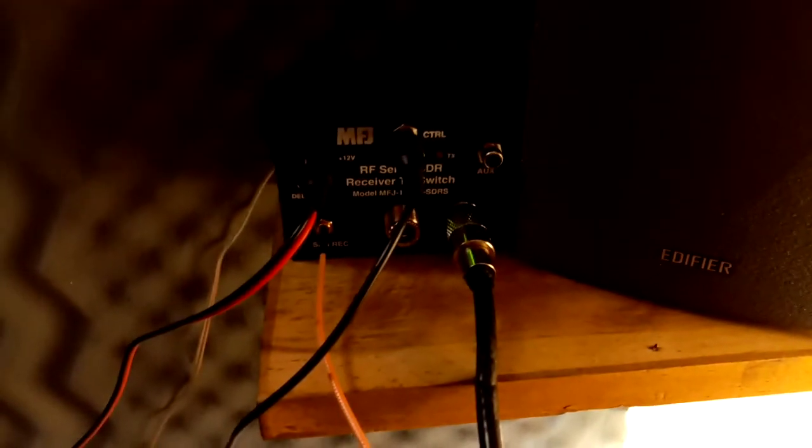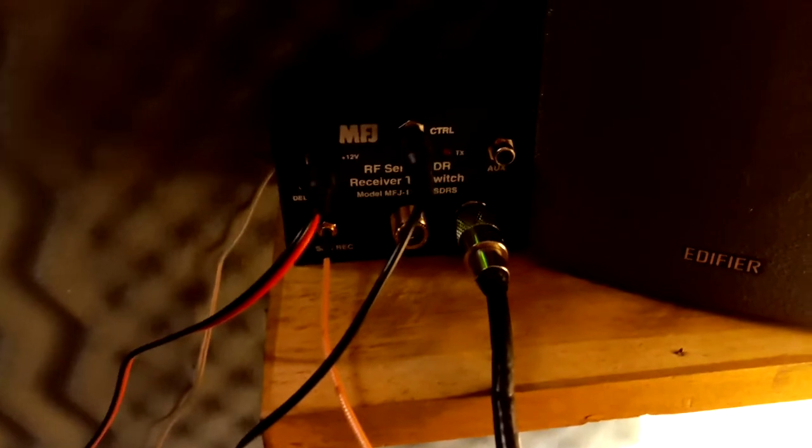Hence, the additional switch. So you bring your antenna feed. This is the antenna line, which comes in from the diversity antenna, which in my case is a vertical. It's a quarter wave. Let me pull this out so the light's a little bit better. It is a quarter wave on 75 meters, and it switches via relay into a half wave 40 and up with a 49-to-1. 49-to-1 is switched in. So on 75 meters, it functions as a vertical quarter wave. And the reason why all of my antennas are horizontally polarized, I wanted a vertical antenna, which is preferably noisy, and verticals technically are a little bit more noisy, generally speaking, and it helps the diversity work.